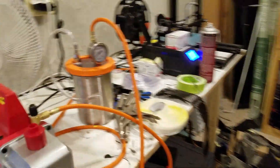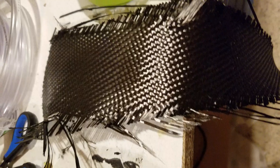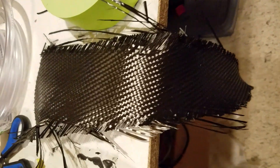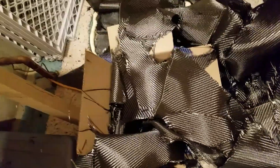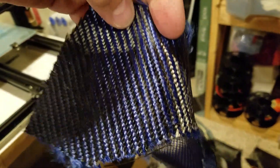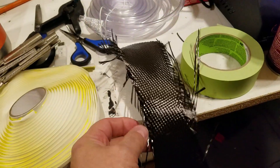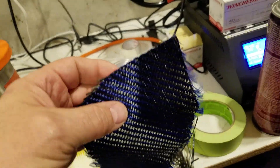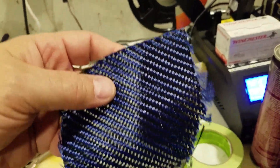Let's talk about some of the equipment. First of all, you're going to need some carbon fiber mat. I get most of my supplies from Composite Envisions. They have various different types of mat and different styles. You can get some that actually have some blue Kevlar in them, which is really nice because it kind of glints in the sunlight, so some accent pieces are going to be done in that material. They also have two different types: the regular type, which frays really well — or badly, as the case may be — and then their web lock, which does not fray as much. You want to use the web lock when you're tucking in corners. But the web lock is $35 a yard, while the regular is about $19 a yard, so bear that in mind.